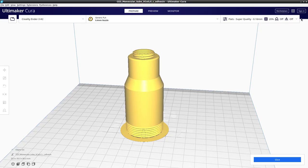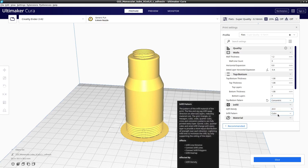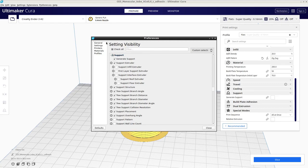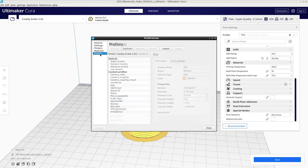There are many settings you can adjust for a particular slicing operation and the choice of settings is crucial to making G-code that works well in giving you a good 3D print. To help people who want to print Puma parts, I provide my recommended settings in the form of Cura profiles for various Puma models. These Cura profiles are settings files you can import into Cura that will automatically adjust the required settings for you for a particular model.